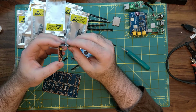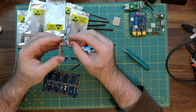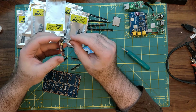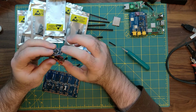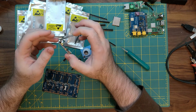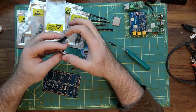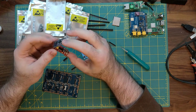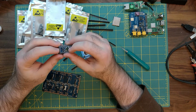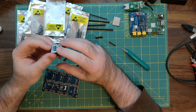And that's because what we do is we put the Arduinos somewhere in the middle, and then when we program the chip, we'll actually squeeze this together just ever so slightly. Remember, you don't want to really grip it together, or else you'll bend the pins. But what you're doing is preloading these pins against the pin walls of the Arduino.